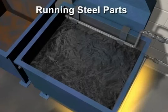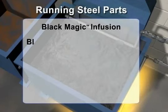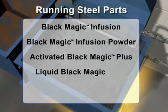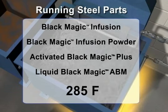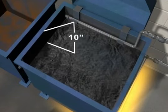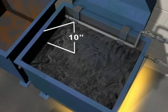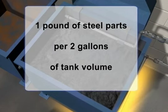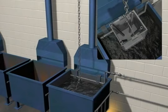The Blackmagic products for steel are Blackmagic Infusion, Blackmagic Infusion Powder, Activated Blackmagic Plus, and Liquid Blackmagic ABM. All of these are used boiling in the 285°F range. The level of the boiling solution should be run around 10 inches from the top of the tank to allow room for the volume of parts to be immersed without overflowing. Tank loading is one pound of steel parts per two gallons of tank volume for a good black. That load will permit the boil to return within two minutes. If the parts are tube-shaped, then lower them into the boiling tank pointing away from you or anyone else.